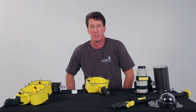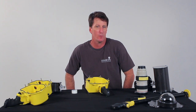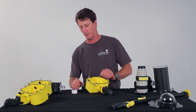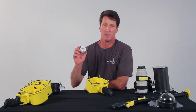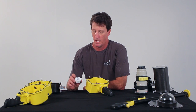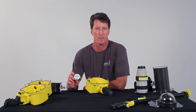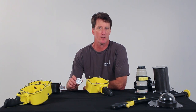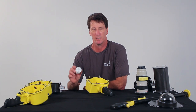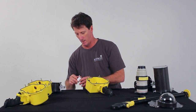Today we're going to be talking about silicone grease and its application to our main O-ring seal and also our control O-rings. Silicone grease can be found at your local hardware store. Go to the plumbing department and ask for silicone grease for O-rings and faucets. If they try and steer you to the automotive section, don't go there. You want the silicone grease from the plumbing department.